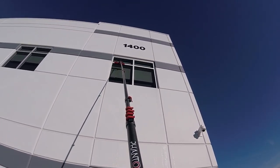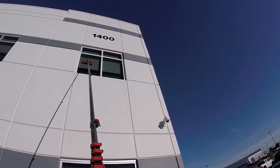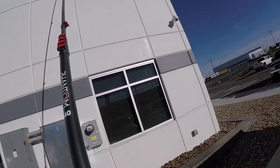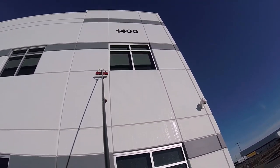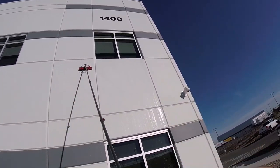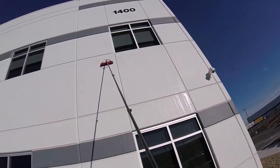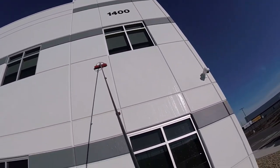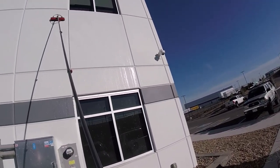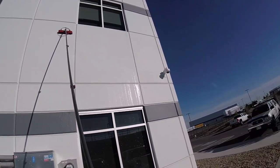So that's pretty much it as far as how to clean commercial glass with a waterfed pole. Just remember that if it's your first time cleaning, it's going to take a little bit longer. You're really going to have to go through and clean all the rubber seals really, really well. Let those drip out — if you don't do that and you think you're going to get it in one pass, you're going to get a bunch of white drips coming from the seals and dirt. The best thing to do is go through, clean all those first, go back, do your top, come back, do your second row. It's going to probably take you just as long the first time as it would to ladder it, but then every time you come back thereafter it's going to take you way less time.